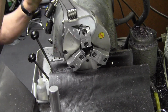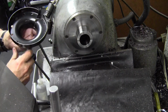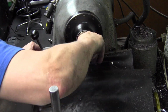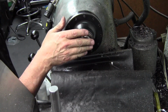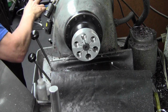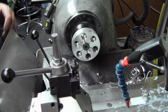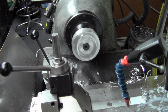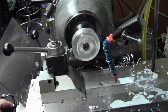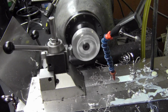Like I said, that's a standard expander from a purchased blind hole lap. Popping the soft jaw chuck off, putting a 1-inch collet in to grab the larger diameter of my lap arbor, and got a little expansion pressure on there so that the expander is actually loading the lap a little bit, just enough that it's in contact. Now we'll do a diameter just a few thousandths larger than where I'm going to end up, so we know where we are, taking a finish cut across.